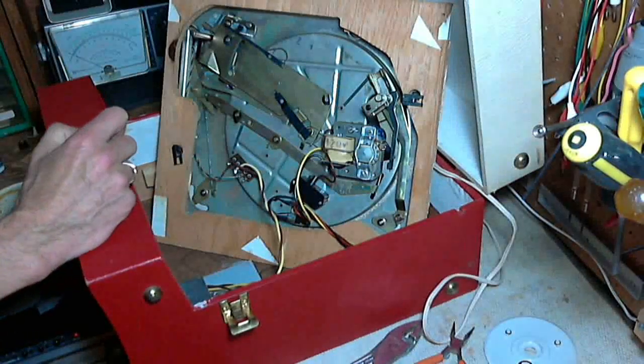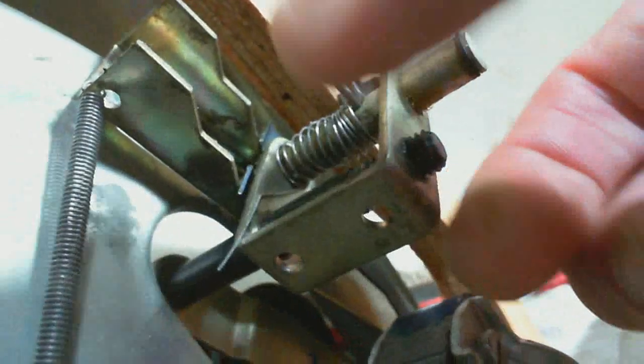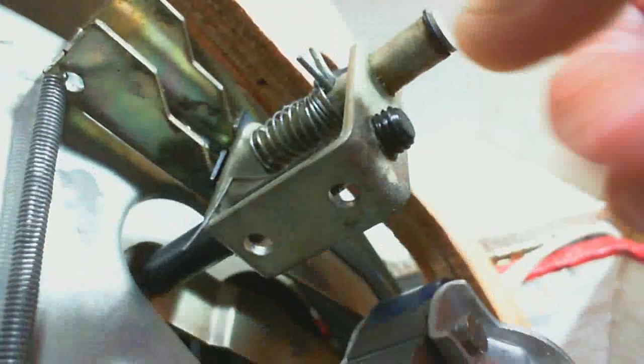I raised my hand a little high there — that hurt. So this will all be moving very, very freely once done. We can see this spring is what's driving it back — this spring has really got no power. That's the speed control there, which is moving pretty good. I think that's pretty dried up — that's what's going on.